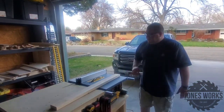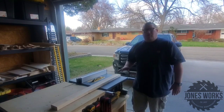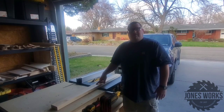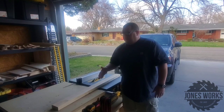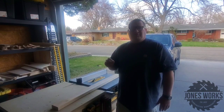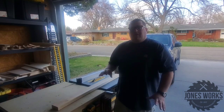And again, using whatever scrap wood I have available. I usually use a hardwood or like a select pine, something like that. All I could find was this 2x4 that I thought could do the trick. So I'm going to cut off the round edge and then cut some half-inch strips that will glue onto the edges, put a nice little chamfer on, and make it look good.